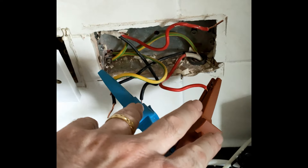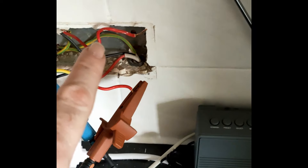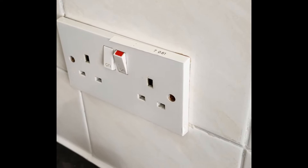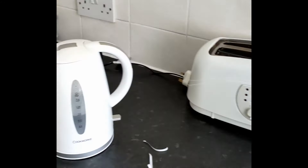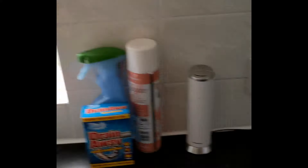This part of the ring doesn't seem to have line continuity. I think this cable comes from here, goes past the cooker and ends up there. That one has a 0.51 reading and this one is a 0.61 reading — that makes sense. I think the boiler is spurred off that last plug. The cable then goes from there either up over the ceiling or over this way, and I've got readings of 0.72 and 0.75 on the two plugs down there.